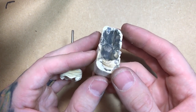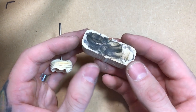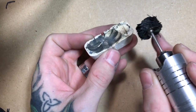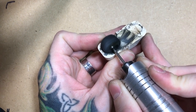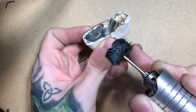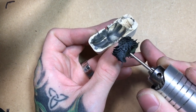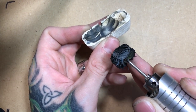You should always be sure to use proper eye protection and respiratory protection whenever you're using any of these rotary tools. Even if you can't see them, there are tons of little particles that will be flying in the air around you, and you want to keep that out of your eyes and lungs. To mount the polish onto your buff, gently run the buff through the polish for a moment to gather some on the wheel. It only takes just a second to apply enough polish to finish the piece.